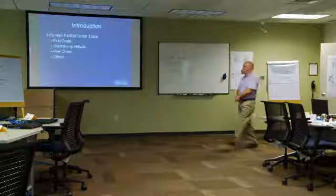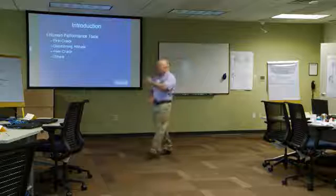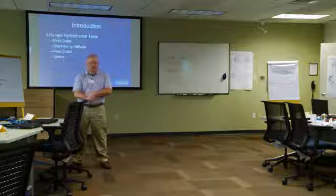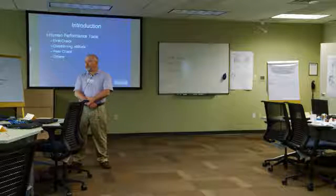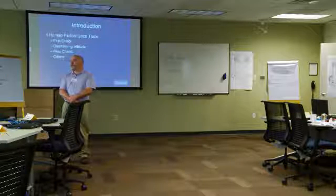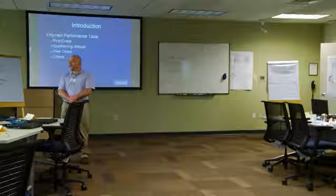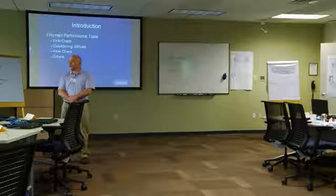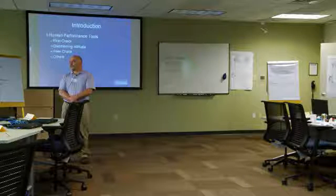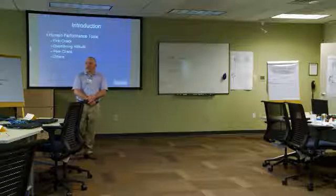Exactly, exactly. Questioning attitude, we can use that. You could probably list 100 things. Steve, keeping in mind this job that we're doing, installing temporary safety grounds, where might you use questioning attitude? Well, if I was to walk up and try to get started in my task and something didn't seem right or didn't feel right about it, I want to make sure before I continue that things are actually like they should be. I don't want to just say, oh, it's already been de-energized, I can just work on it. I want to verify. If I have a question in my mind, I want to alleviate that question.